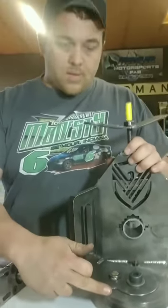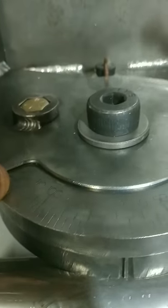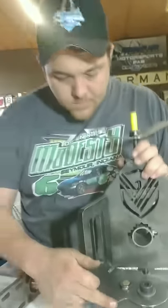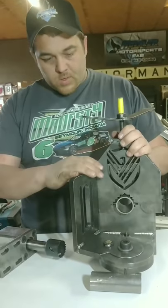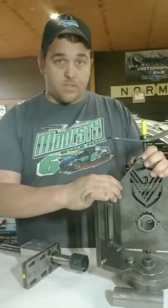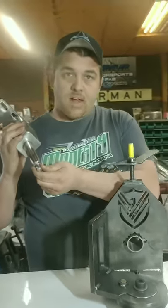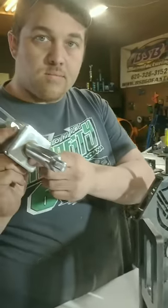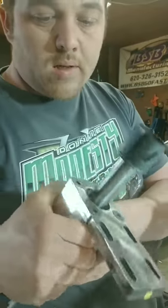Your degree wheel reads 110 degrees from center. He's got zero set straight across, so you've got 220 degrees total. It's all really heavy metal — quarter inch, three eighths, half inch — so it should last quite a while. You've got a solid shaft with an actual drill coupler, brass bushing, no needle bearings, solid housing.